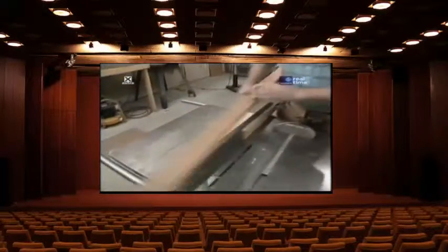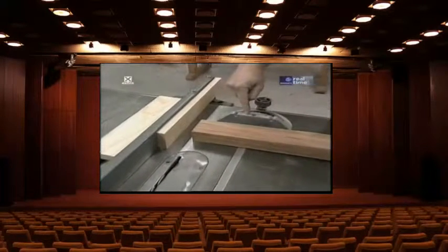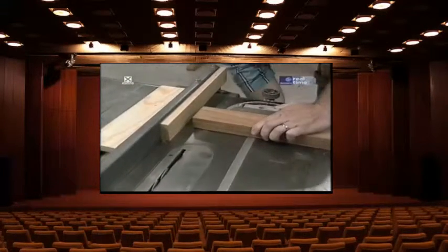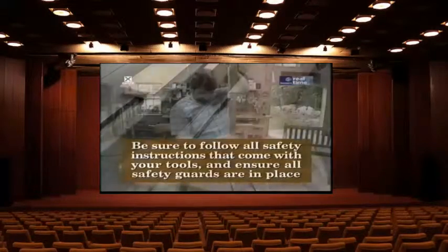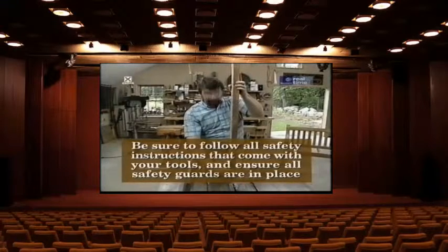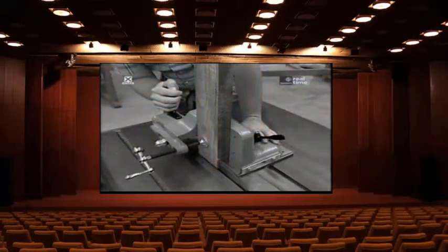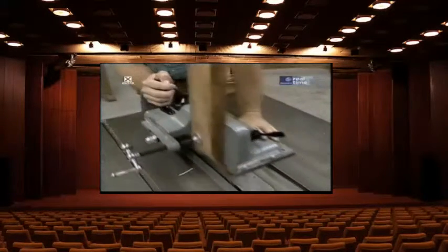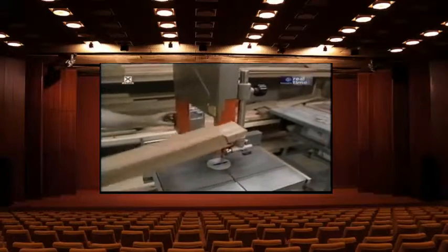Now this is a piece of 2x3, which is the bottom rail of the back. And using my guide block and my T-square, I'll make the shoulder cuts first. Well, I could finish off the tenon by nibbling it away, I suppose. But since I have enough height here in the shop, and I've got my tenoning jig, this is the way to do it. Now I have to trim the narrow side of the tenon. And again, I could cut it by hand, but why waste a bandsaw when it's right here in the shop?